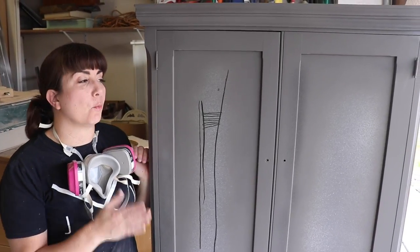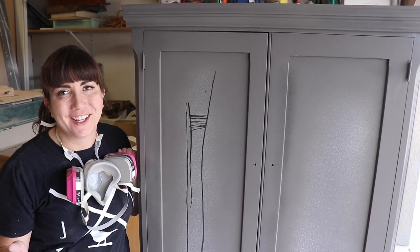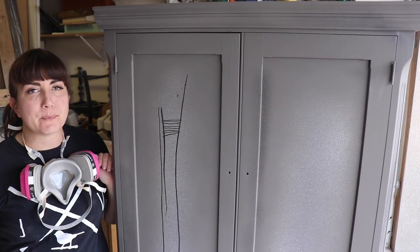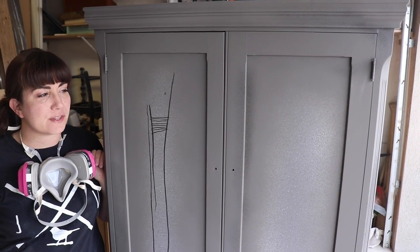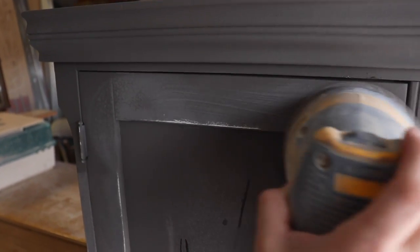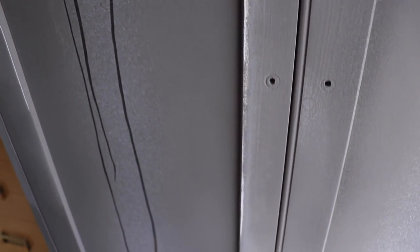This piece was painted with White Swan, but I ran out — can you believe it? I ran out of White Swan — so then I decided to paint it in Weathered Wood, and I had a few drips, so we sanded those, repainted those areas, and I'm getting ready to distress it. You'll kind of notice when it distresses that you're going to have the dark with the white peeking through, and then some of the original finish, which I think is going to be fun.